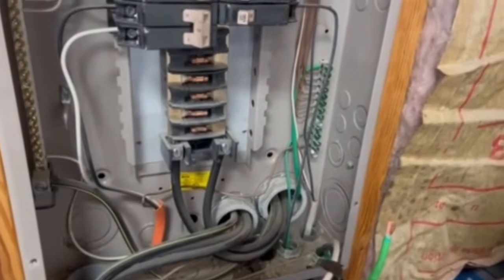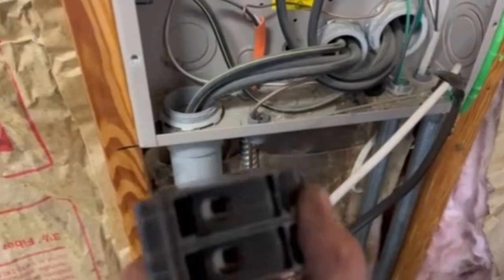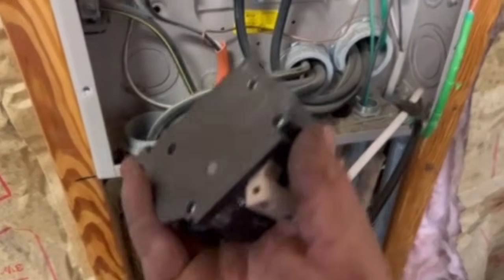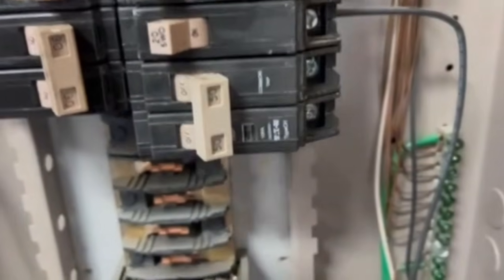The kid that plumbed in my garage to begin with did it from Home Depot, which is really good because it's just down the street. I've got an Eaton breaker here. I've already got my wires cut. My ground is going to go in right here — there's a big lug for the ground there. These two wires, it doesn't matter which one: one's going to go in the top hole and one in the bottom hole. Then I'll screw those together and the breaker is just going to snap in. You can see the lugs right here.